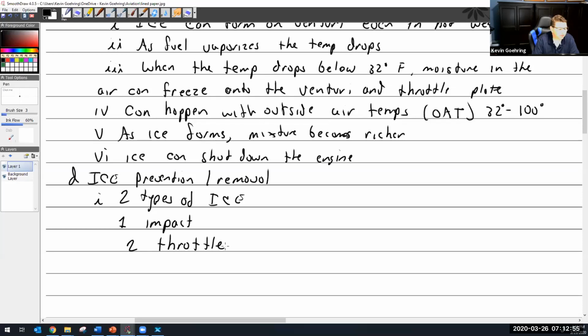When I fly my airplane, carb heat goes on, I land the plane, and the first thing I do when I hit the ground is carb heat off, because it's completely unfiltered air down there on the ground, and I don't like that. I think that's a safety reason. You don't want two filters plugged. If you're going to get one plugged, why risk it? So yes, carb heat is unfiltered. Cool? No, it's hot.